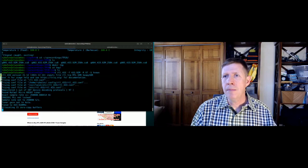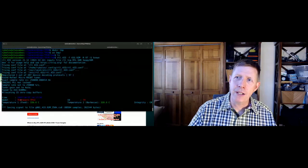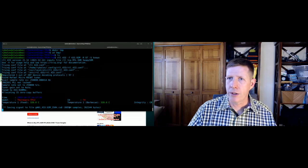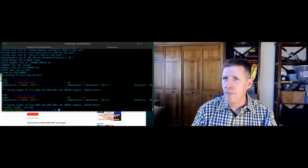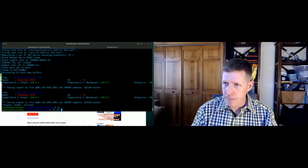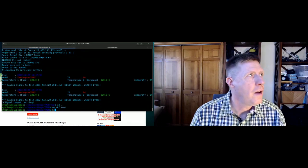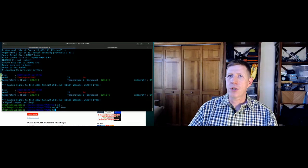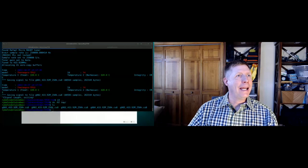Okay, so here I am. I'm waiting. It'll take a couple seconds. So here, it identified the device, identified the stuff, and it saved it to this particular CU8. So here's another one, and now it's G02.cu8. So that's what I did. Okay, rm -rf. So that's what I did in order to get these files that are here. But you can still operate on those files, which is cool. And that's part of what RTL-433 was designed to do. You can do an analyze on them. And I have to use a cheat sheet because they're different.